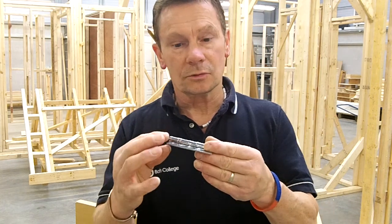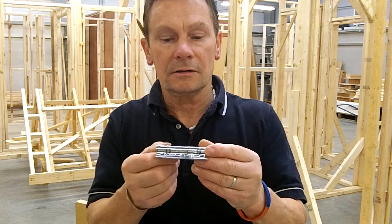Marking out hinges to a door can be done in two or three different ways. Some people just prefer to use a square and pencil, marking them out nice and neatly. Other people may use gauges to make sure they've got the right distances. Other people just offer the hinge to the door and mark around it with a knife or a cutting knife. Either is quite usable — whichever way works for you is fine. The outcome is what we're trying to achieve: the hinge should be fitted into the door nice and flush, not rocking on anything, not twisted, and quite parallel to the front edge of the door.